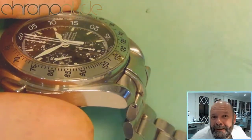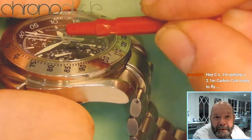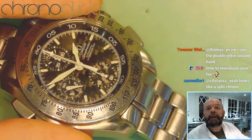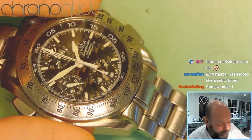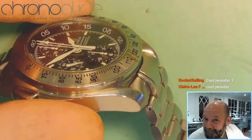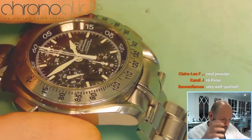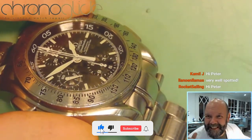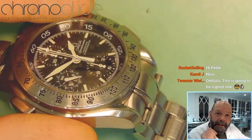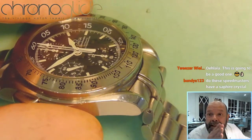The watch doesn't run at all, so I didn't see the second chronograph. Now this is interesting because here you can see two different second hands. All of you know it already, I don't do any work up front, so in the watch I don't know what to expect, so that keeps it nice and fresh, and an adventure for me as well. So Rattrapante, interesting, and that means nothing too complicated. Usually with a chronograph you can start, stop the second hand, but there are two second hands for the chronograph. So you can measure an intermediate time.